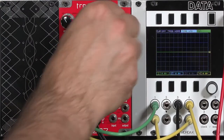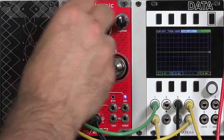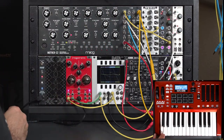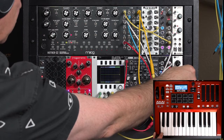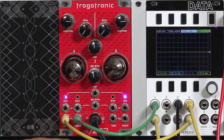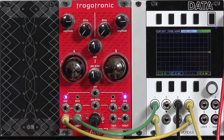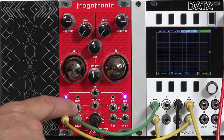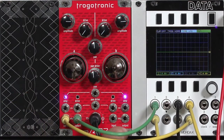I'm trying to drive both channels. I'm going to turn the amplitude up in both channels and turn down the input volume. Now if you have a stereo signal, you can bring it into both the left and right inputs. If you only have a mono signal like I have here, it's normaled internally from left to right, so I don't need to patch in two inputs.